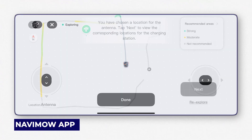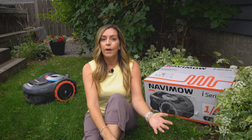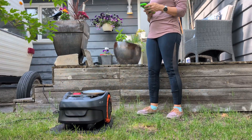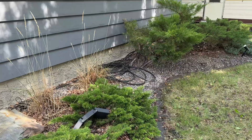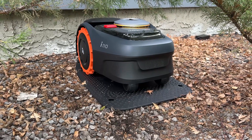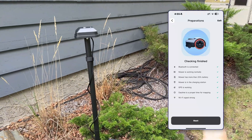The good news is you won't be testing in the dark, since the Navimo app comes with a built-in feature called satellite signal analyzer, which can scan the area for visible satellites. Essentially, you'll drive the mower around your yard and as it goes, it gauges the ideal location where it can get the best view of the satellites it needs to see. It did take me numerous tries and several placement locations before I was able to find an ideal spot. Because you need to keep the charging station at least two meters away from the house and trees, while also staying close-ish to a plug, this can be a real challenge. I did have to try placing the mower against my house, but had to move it when I was unable to pull in a satellite signal. Those extension cables included in the box really came in handy, but if you ever need a setup where the charging station and antenna are really far off, you can buy extra lengths. Once the app gives you a green light on your placement of the base station and the antenna, it's time to map your yard.